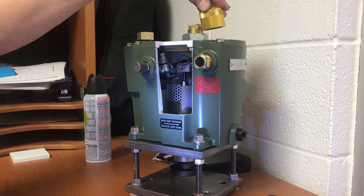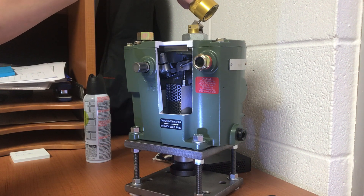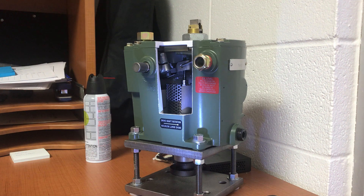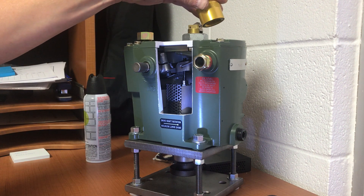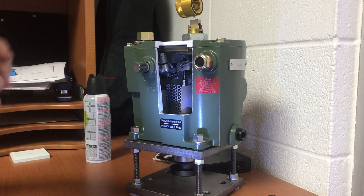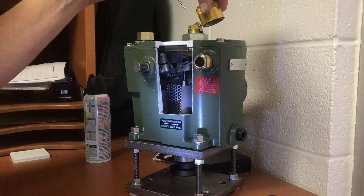You push it down — it's very easy to push down, very nice control. You slowly push it down and right there you trip your turbine again. It runs down, come back up, wait for your turbine to run, and for your third trip you do the same thing — just actuate it in and you should get your 3,150.